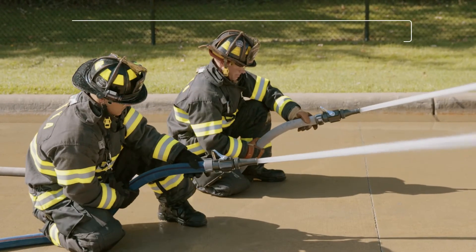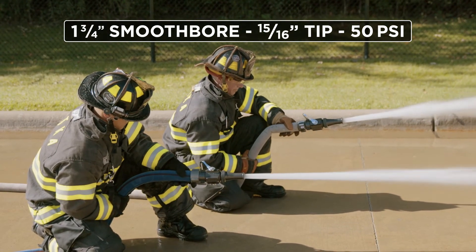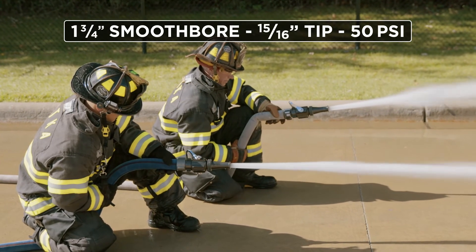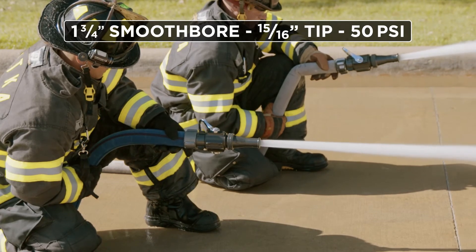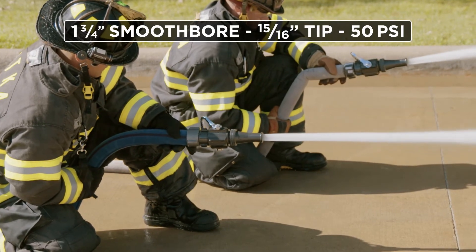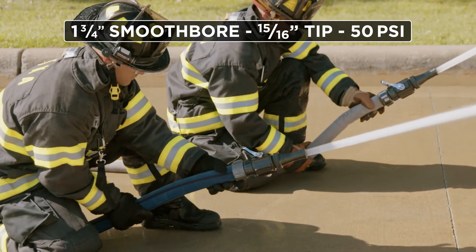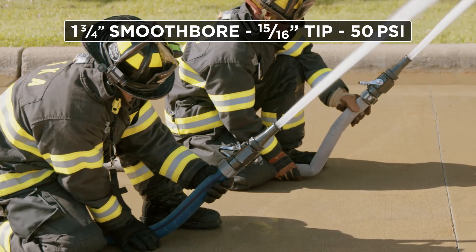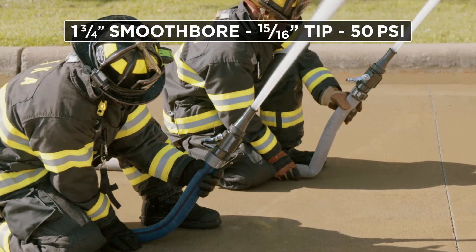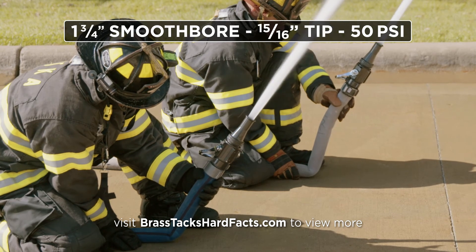In this portion of the side by side comparison, again we have two identical nozzles — 15/16 inch smoothbore. We're seeing a little bit more aggressive reaction on the hose on the left, primarily because we're using a smoothbore, which is a volume type nozzle as opposed to a constant pressure fog nozzle where we had a restriction in the stream that creates some back pressure. So again you're seeing the hose on the left with a higher propensity to kink, in this case endangering the firefighter on his interior attack.